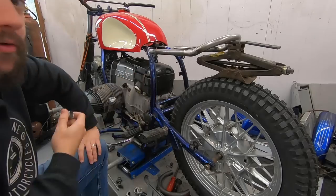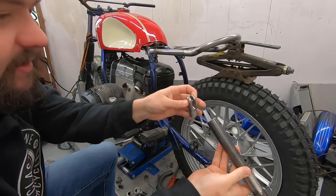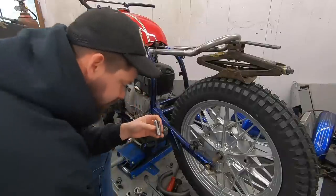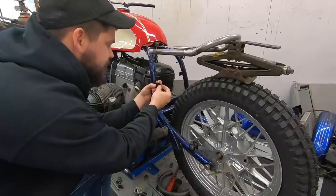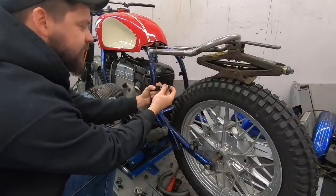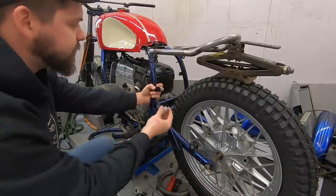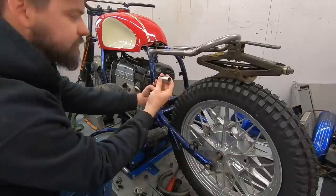So this is what I have landed on — it's called a clevis joint. Very similar to the other joint, it's designed to slip into the end of a tube and be welded on. That's going to give us a nice sturdy mount that we can mate up to a small tab on the frame, about a quarter inch thick, wherever we want it. We can weld that in, this will slide right over and bolt on — a nice strong, completely removable joint.